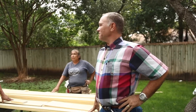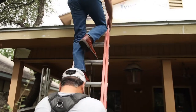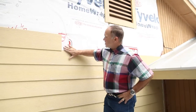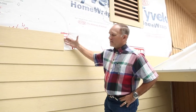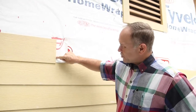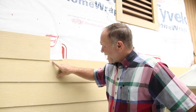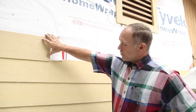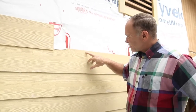Juan, why don't you join me up there? It's a little wet on the metal roof — a little slippery. We'll be all right though. If I fall, you'll catch me. Here's the shim that we put in here. At each joint, when we butt a joint, we're putting in a Tyvek shim that allows any moisture to travel right back down onto the siding. This also shows the blind nailing that's below the next sheet — so this completely covers it, and look what a great job with those nails. Just perfectly flush.